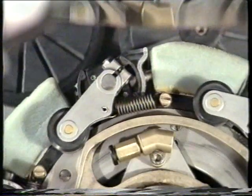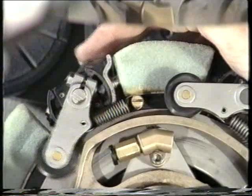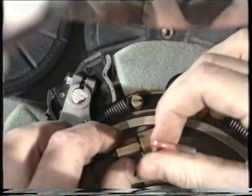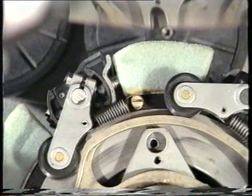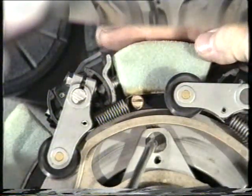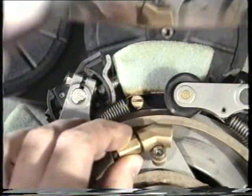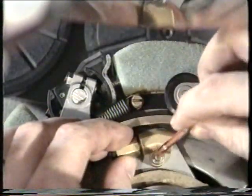For setting the air blast, the machine is inched until the finger is open to about four millimeters. The plug support is removed. The opening of the air channel must be in the center of the support. We do a blast test in order to ensure that this opening belongs to our segment. This is also an operational check.